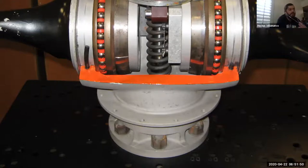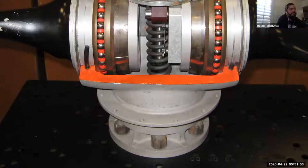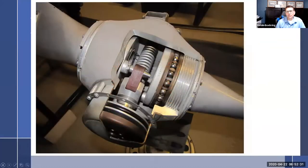How do you manage to put the pin on it? Not as the mechanic per se, it wouldn't be too hard putting it in. It'd be hard taking it out. Well, okay. So the hard part is, to safety this, you have to put safety wire through the middle of that roll pin. And sometimes it locks like this and you got to get that safety wire back around here, then start your twist back in that little corner, and it's .041 safety wire. And you got to bring that twist over and then back through here and underneath, it's really hard, but the studs are sticking out the bottom. So maybe go back to some of the other pictures and you can see that one's the real hard one.